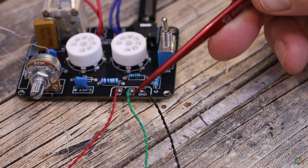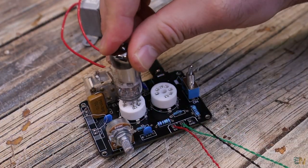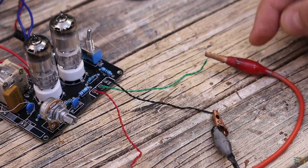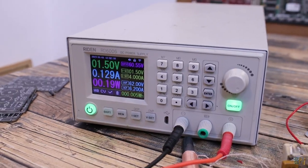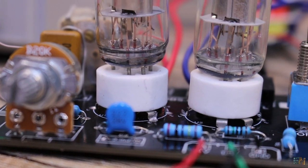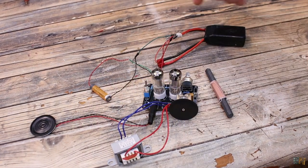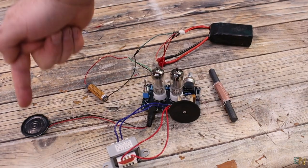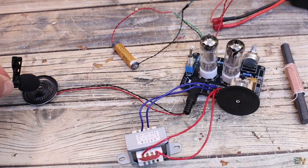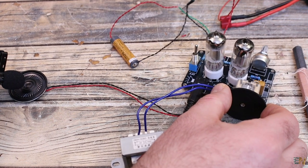To the board I add three wires: ground, 1.5V, and 9V. Now I can add both tubes. Supplying only the 1.5V first, we see a consumption of around 130mA — using a small battery it won't last too long, because the vacuum tube heating filaments use a lot of current. Everything seems to work, so now I supply 9V as well from a different battery. The circuit actually works. The volume is very low, but it works. I place the microphone close to the speaker and we can hear a random radio channel.